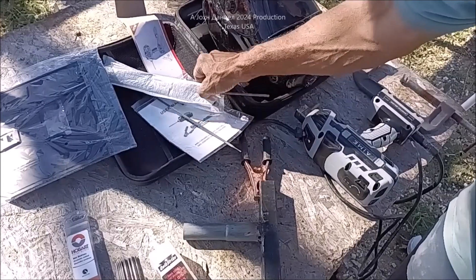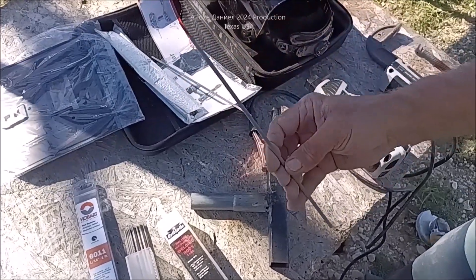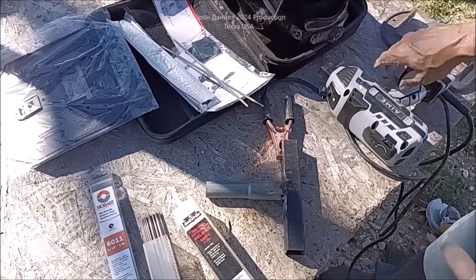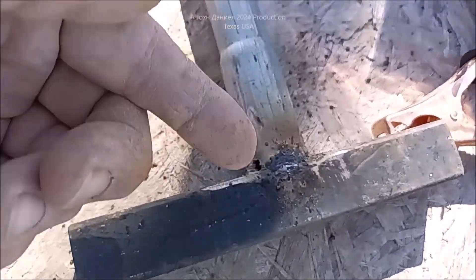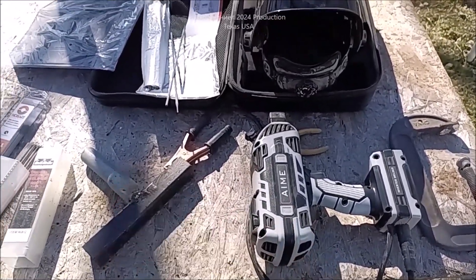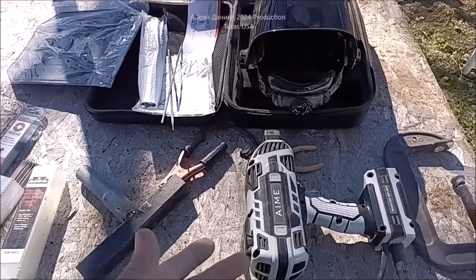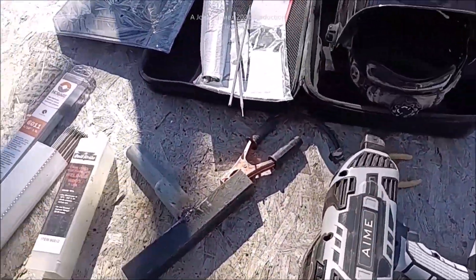It comes with a hood that's about as worthless as tits on a boar hog, but if you're in a pinch, hell, that'll work. I wouldn't say these rods are going to do you a lot of justice, but they may — I haven't tried one very long, just did a short run with one. It stuck twice — I jacked it up to 5 and that's what blew the hole through it back here. Pretty crappy because of the two different sizes of metal thicknesses.